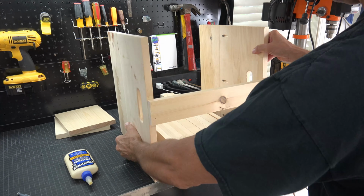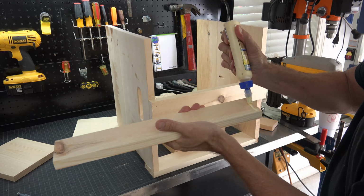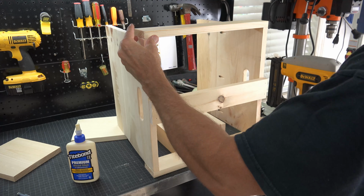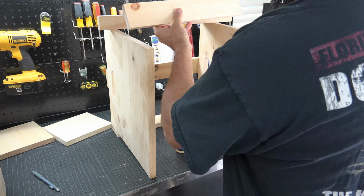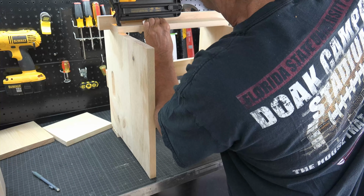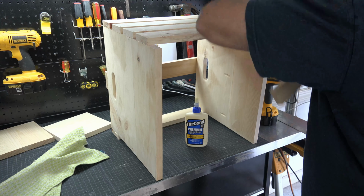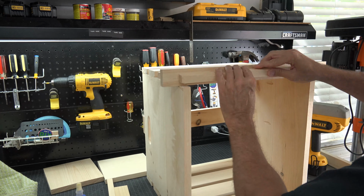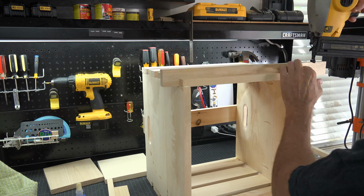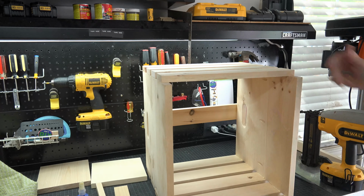Once your center top and the side supports are on, start filling in the sides top down. So your odd piece out is on the bottom of the box. For the spacing, I simply use one of the scrap pieces on its side. You will continue this until both sides are filled out. The bottom or last piece of each side will need to be trimmed to fit flush with the edge. Then we can move back to the top.